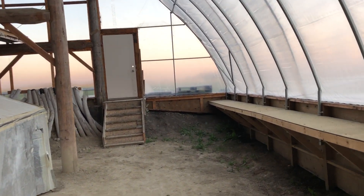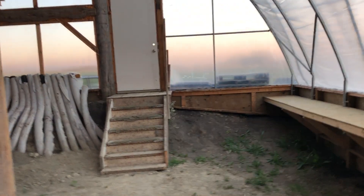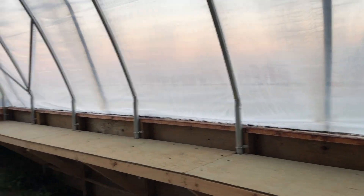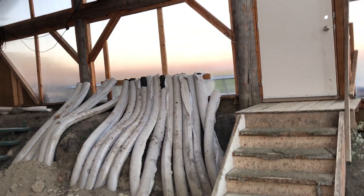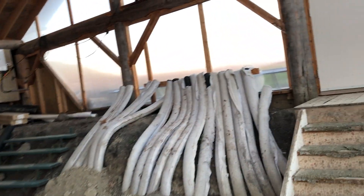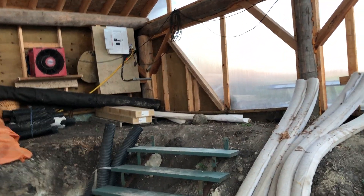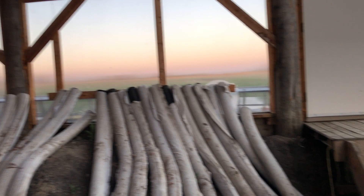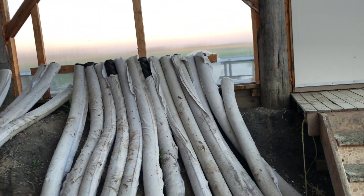One other thing I forgot to mention in the last video: I did create a frost and water skirting curtain all the way around the whole periphery of the greenhouse. From the outside, buried about six inches below the final grade, is some blue board rigid foam — R-15 per three inches — buried four feet out, all the way around the whole perimeter of the greenhouse. Then there's about eight feet of poly also buried down there to shed out water.